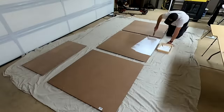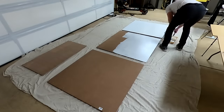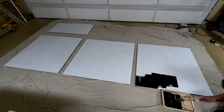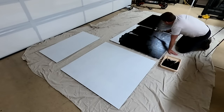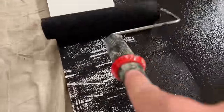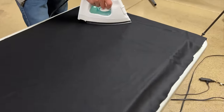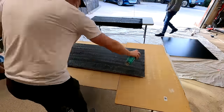After that I wiped all the panels down and proceeded to paint a solid primer coat on them, because MDF board is really absorbent and I was going to be using a spray adhesive for the fabric. I wanted to make sure they were well treated so the glue wouldn't just get absorbed into the MDF. I painted another coat of black on top of the white base primer because I didn't want to risk any of that white showing through when drilling through the fabric.